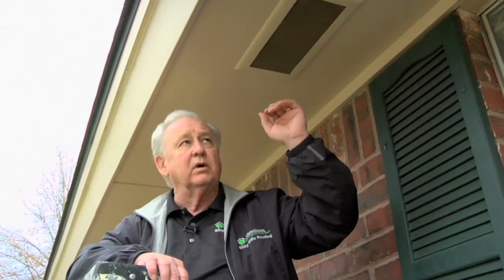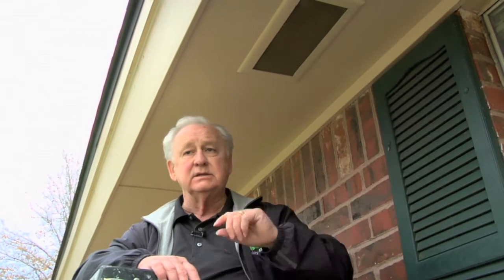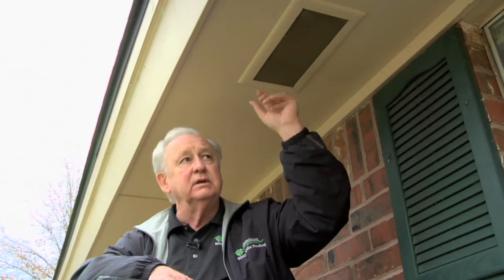The key to the Thermodact working is actually making cold air rise. The question I get is: how do you make cold air rise? The way you do it is you heat up the air above it, and that's done by natural radiant heat heating up the decking, heating up the composition roofing, and heating up the air in the one-inch airspace. It naturally rises, and that creates a siphon effect which draws cool air in from the soffit and then expels it through the vented ridge.